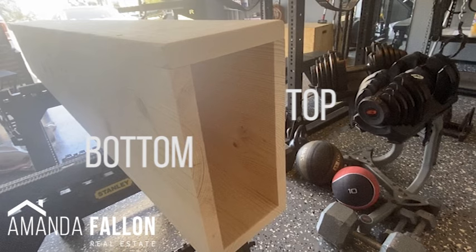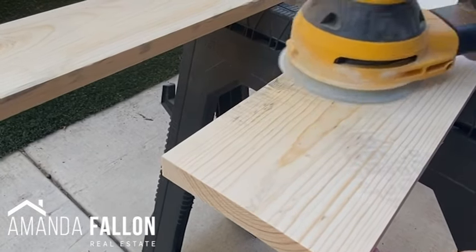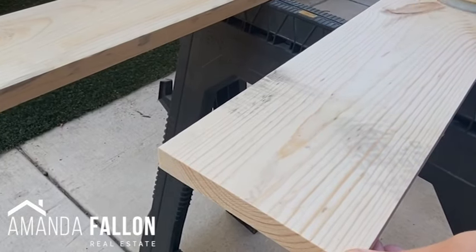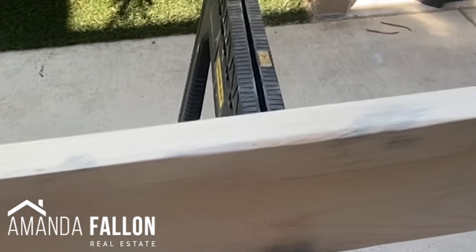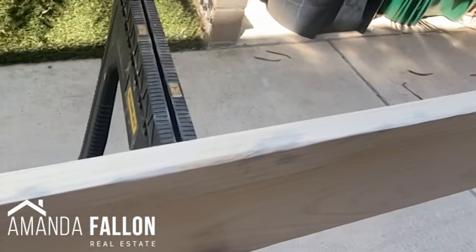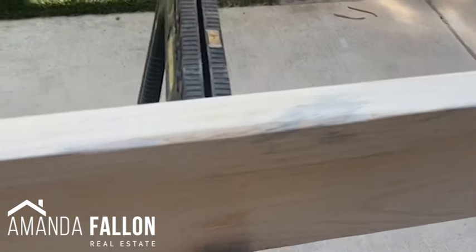Once you've established your wood for your box, you're going to start sanding. To save time, I only do a thorough sanding on the sides of the wood that will be exposed. You also want to identify the prettiest sides of your wood and plan to have those on the exterior of the box. Using my electric sander, I softened the edges of the shorter boards of pine — you don't want to do this to the longer boards. By softening and rounding the edges and taking some dings out of the corners, it gives it a really cool rustic appearance that looks great when stained.